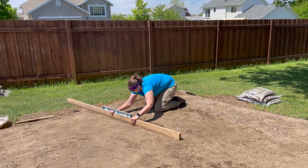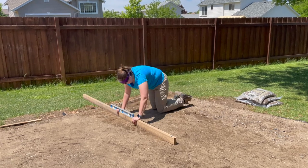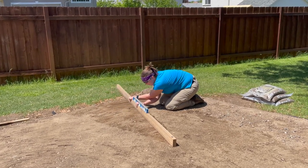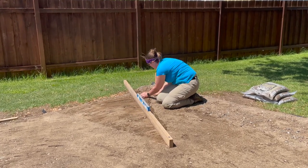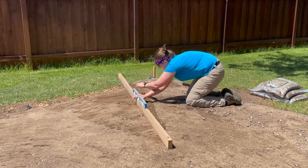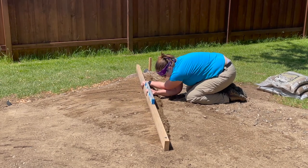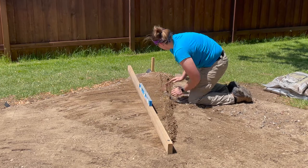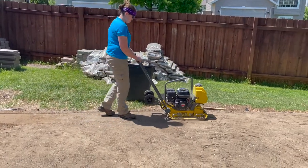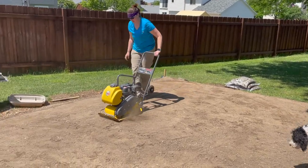Here is a closer look at how I use the 2x4. I make sure I have plenty of sand against the board along the entire length, with my hand holding the level down on the 2x4. I'm slowly pulling the 2x4 with my eyes always on that bubble. There are times I need to lift up to allow sand through, or dig in to scrape it. If I see the 2x4 is not touching the ground I take my hand and scrape more sand up there, then re-go over that area. We did rent a plate compactor for the final compaction, though we used a hand stomper as we went.